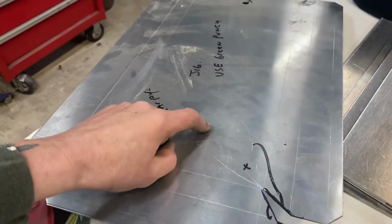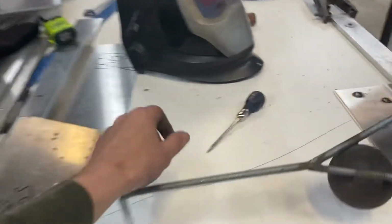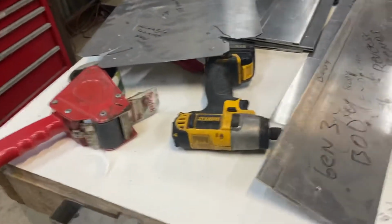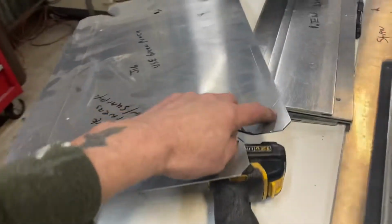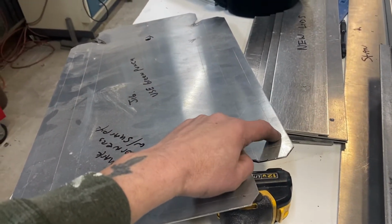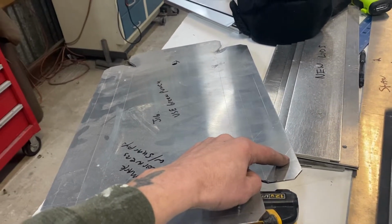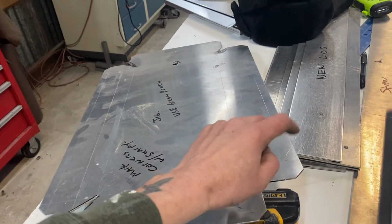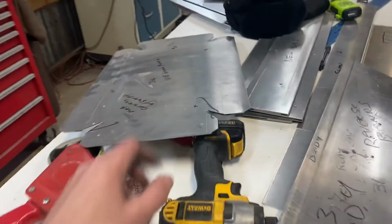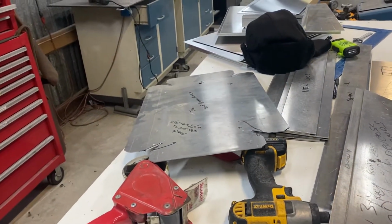One thing about building these jigs is that they do wear, because you're running basically a piece of steel up against a piece of aluminum. That particular pocket jig, this distance here, is used on lids, end caps, and bodies. So it's used on all three pieces, which means it's also the one that wears the most. So if I was going to lose one, that would be the one to lose, because it probably needed to be replaced anyway.